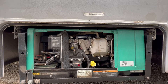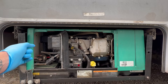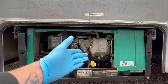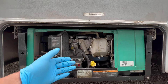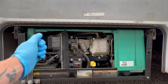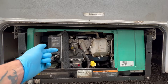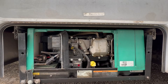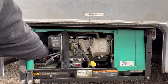The first thing we can do to make this easy is check the cooling fan at the back of the generator. This is a single-cylinder engine, so even with the spark plug in, it's very easy to overcome the compression. If you're having trouble moving it, there's also a 14mm socket on the center of that fan. I'm going to put my hand back there and try to turn this over by hand.